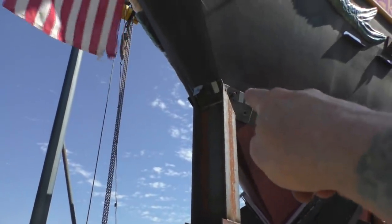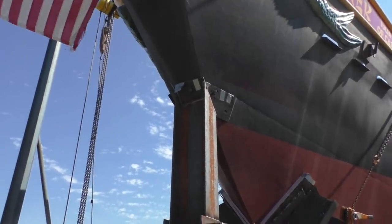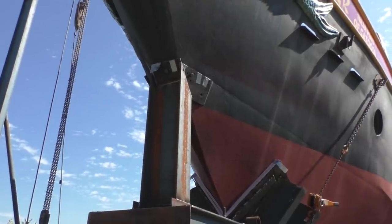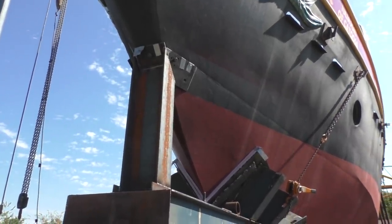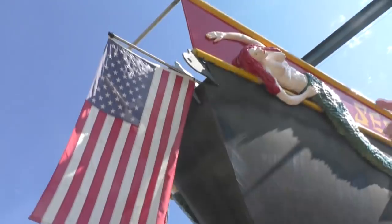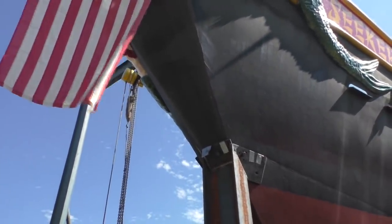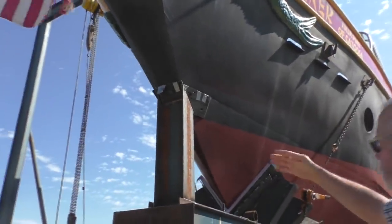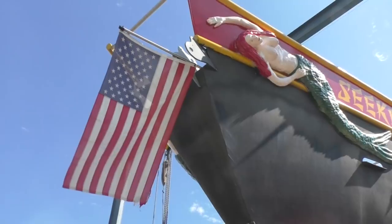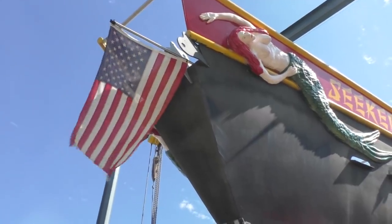These bolts here are 40,000 pound grade 8 bolts. Sure. How thick is that hull? 1/4 inch steel, and it's got some flat bar behind it. I'll take it up here and show you. I'd probably just put an eye on the front of this and run chain off of that to the eye. That's easy to do. That way there's no way it can go down any further. And if you got a diagonal on it, there's no way this collapses underneath it. I'd feel safe moving it like that. I can do that because those are bow rollers up there. I got pins that go across that are 2 inch diameter. I think that'd be fine.